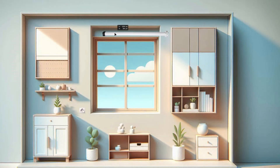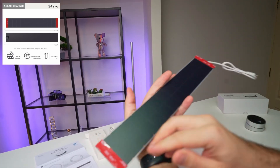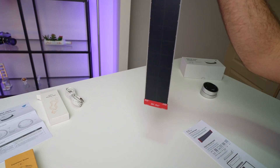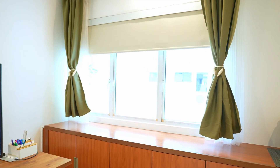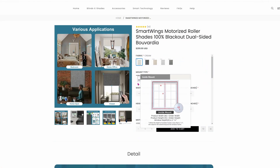After taking all the measurements, consider how you will be powering the shades. While they come with batteries, you might prefer a permanent power solution using direct wiring — plan the placement of the power connections carefully, ensuring it's near power outlets or easily accessible. In our case we positioned the power connector closer to the wall to simplify potential hard wiring in the future. An optional solar panel can be installed on the window to enhance battery life, but its effectiveness depends on your specific needs and the amount of sunlight the window receives. In our tests over the past month, we've noticed a decrease in battery life despite using a solar panel, as the window only gets less than one hour of direct sunlight a day. Additionally, the cable for the panel is quite short, so plan carefully before choosing this option. If you don't like the appearance of the panel, you can always adjust the blind limits so that when it's fully opened, the blind covers the panel from the inside.